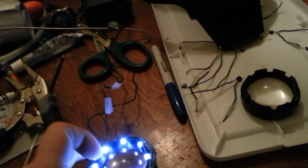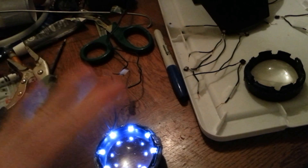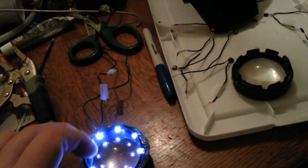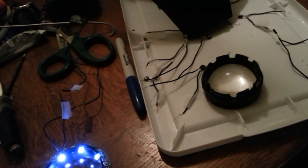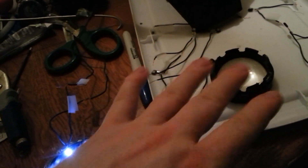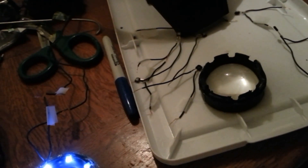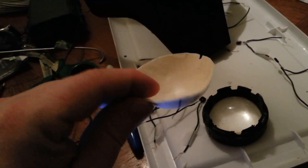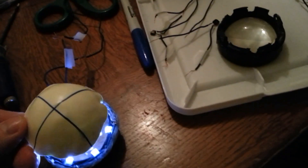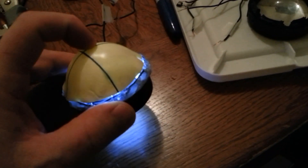The issue is that we have all this light shining back away from the front, and we need to reflect that back forward. So what I've done is taken the glass lens out, taken a piece of plastic, heated it with a heat gun until it melted around the form, and cut that out to make a roughly convex piece which fits on the back.